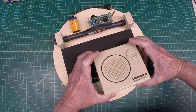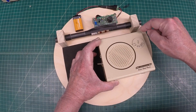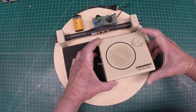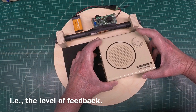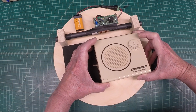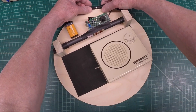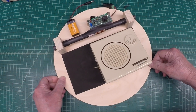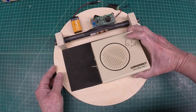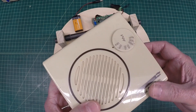The coupling between the ferrite and the receiver is important. You can see I get to the point of oscillation taking over the receiver itself from the circuit. I can actually reduce the gain here on the little precision resistor, or move the receiver ever so slightly. You can see how much it improves reception just using the ferrite rod coupled back to the receiver itself — and of course you get nothing just using the AM receiver by itself.